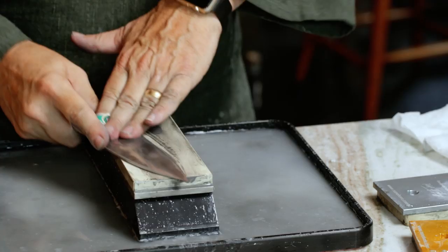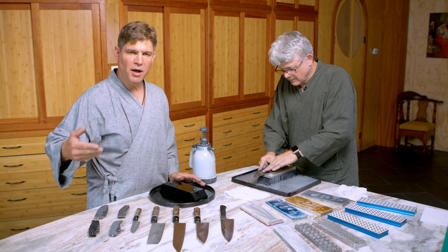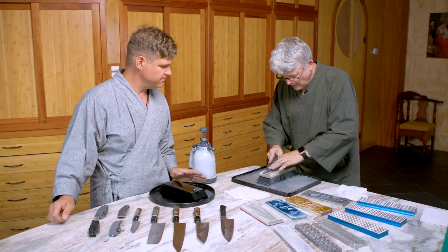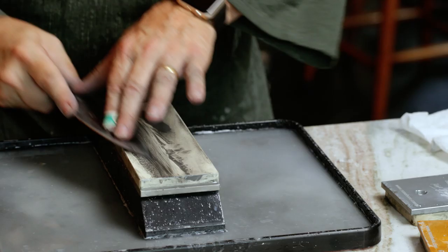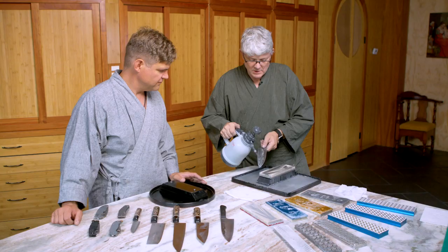If you don't have time, you just kind of push right through this step. What I found in the process of polishing is when you move up to the next grit, it will either polish the surface perfectly, or it will reveal deeper scratches from one or two grits back. Either way, it's instructional if you observe the surface you're polishing — that's how you can decide if you want to drop back a grit or two to get out those rougher scratches. I've just picked up into the primary edge, and it feels really good — I can just feel that edge gripping the surface. I think the next thing is clean up, and are we finally at our jointing? We're going to go for it.